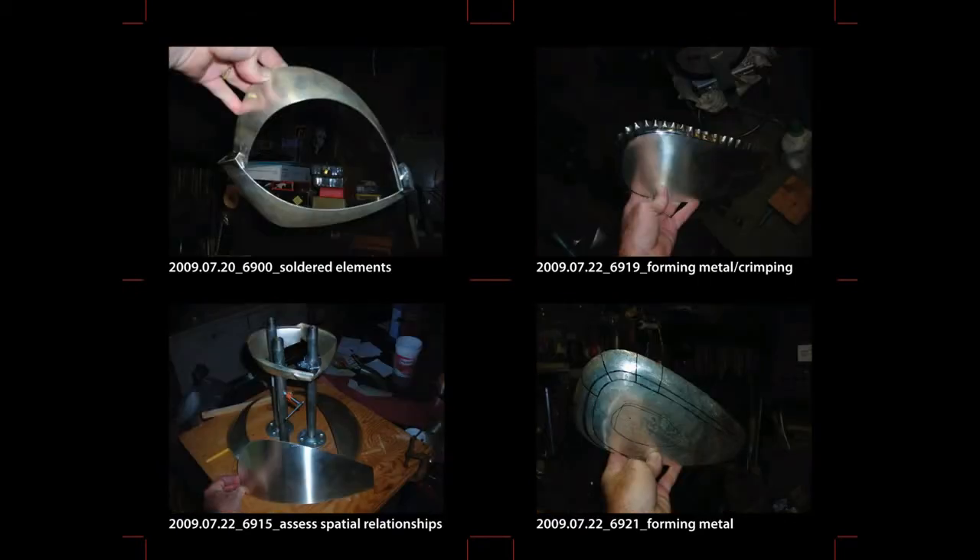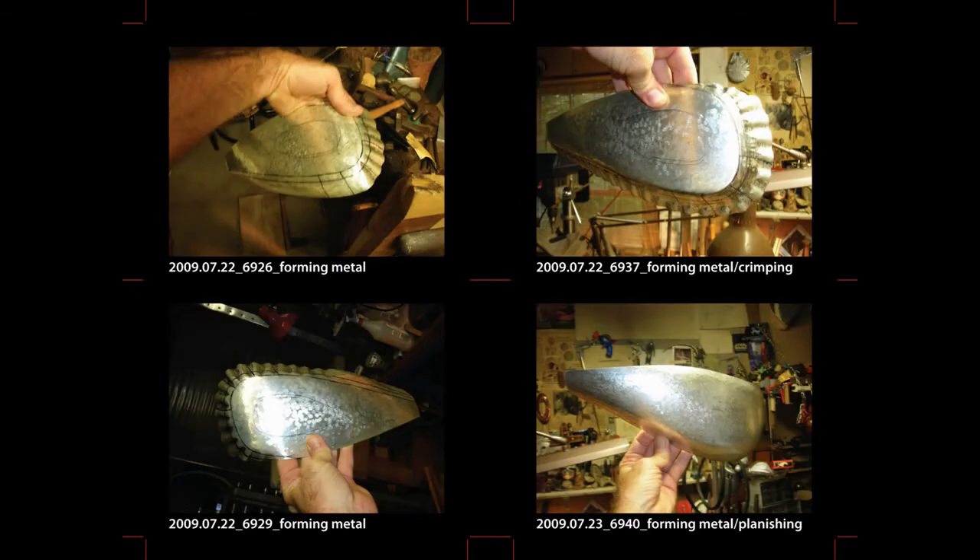Here's forming in various stages. This piece right here is a flat sheet that's been just curved. Now what I'm doing is I'm crimping the edge so that it can create more of a volume — so it's not just a flat sheet that's curved, it's actually curving in more than one dimension. Here it's been hammered out, still working on that same element of the vessel, more crimping. And here's where that final piece is all nicely formed — a really lush shape. You can't do that unless you use a lot of hammering, a lot of planishing over steel stakes to get the metal to actually have a volume to it.